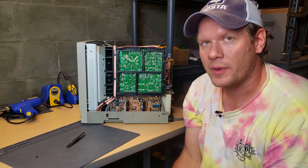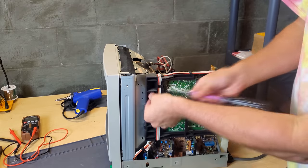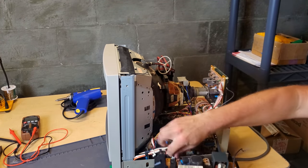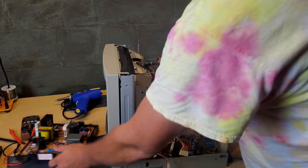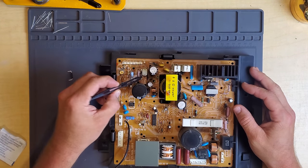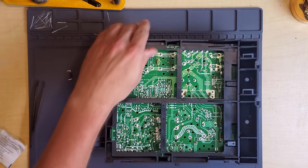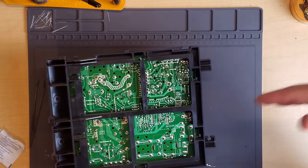Hopefully that can at least get us to the point where we'll be able to get some power into the main boards and get this monitor to power on. Let's go ahead now and get started on this repair. Our fuse is right up here - that is bad, right in here where my tweezers are. So we need to get it out. Thankfully, this is going to be pretty easy. We don't even have to take it out of this plastic shell to get it out because the points here are pretty accessible. So we should be able to desolder this pretty quickly, get that fuse out, and then get the new one in and soldered into place.